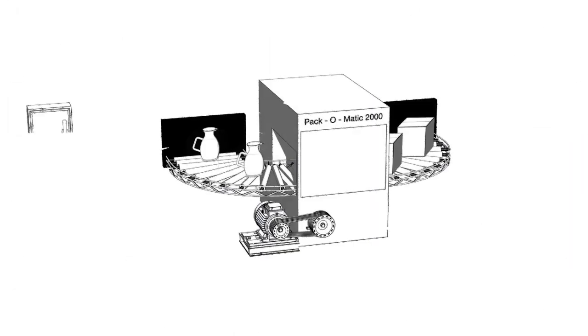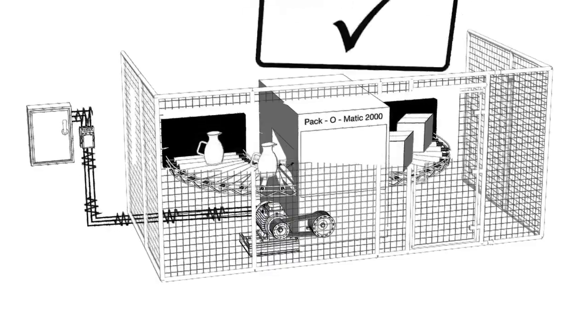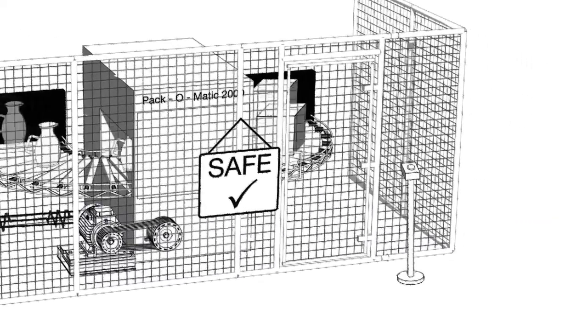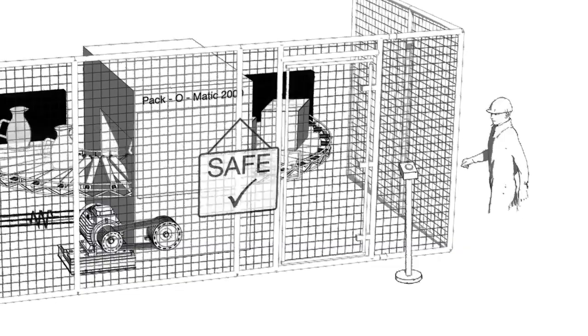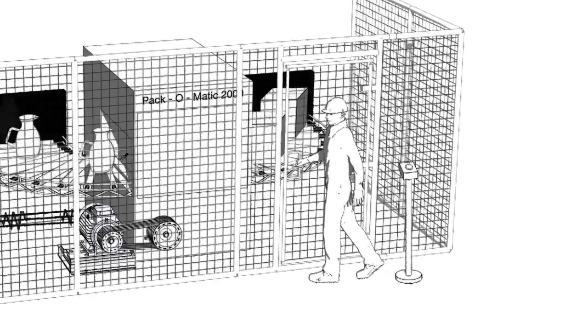Machinery designers have always engineered safety into their machine designs, and now more than ever, legislation puts onus on the designer to show how and to prove it. Normally you'd have to do things like fit an emergency stop button and sensors that react if someone comes near a machine or opens a safety cage door.